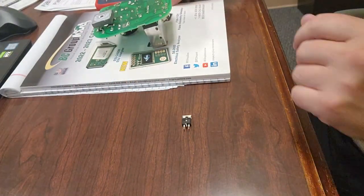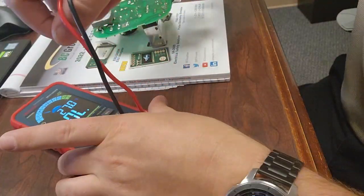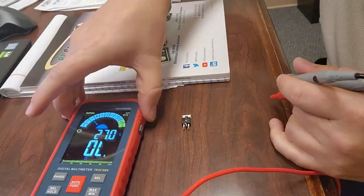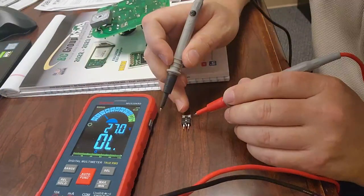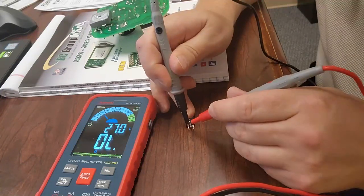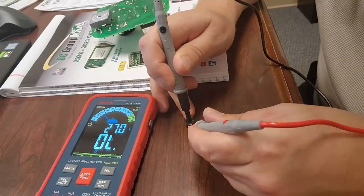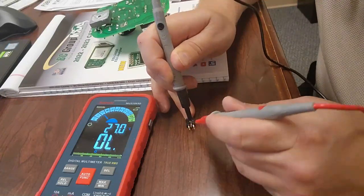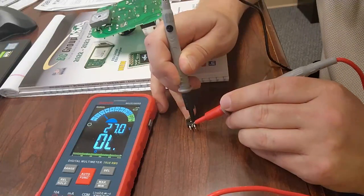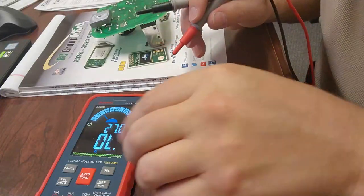So this is your negative rail through the SCRs and it's positive on the capacitor — it says M-positive — but either way it still acts as a shunting diode. What was happening is I could hear the SCRs buzzing, telling me they were running fine, but one leg of this component was showing a voltage drop while the other was showing a dead short. Let me show you exactly on my meter how the failure happened — this isn't just theory.